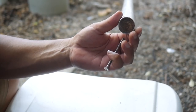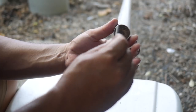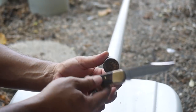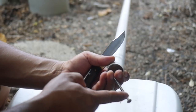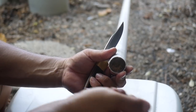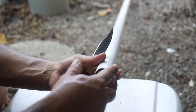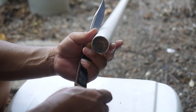To build the tip, I take one three-inch stainless steel screw and embed it right in the center of the wood end, screwed in so the eye is flush. Then I use my Buck knife to shave the wood down into a point, use a die grinder to cut off the screw head, and then rough it out on the concrete patio, which acts like sandpaper and is abrasive enough to sharpen the stainless steel into a nice point.